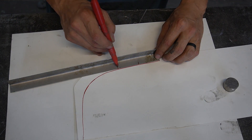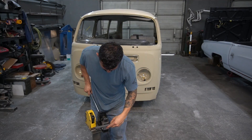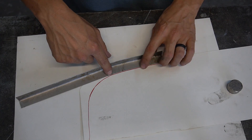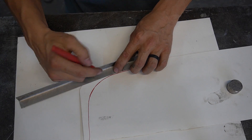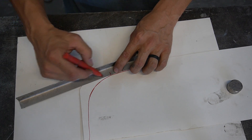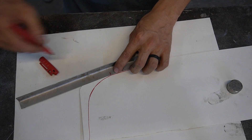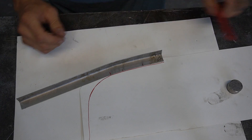It was starting to veer off here, now it's veering off over here — that's where we're going to shrink this one. So now our corner moved to right here, and we're getting into this tighter curve. I'm going to mark it right where it starts to veer off, put a couple of shrinks in here, and try to match that curve. Usually you do a couple of shrinks, bring it over, check it, do a couple more shrinks until you've got the curvature you want.